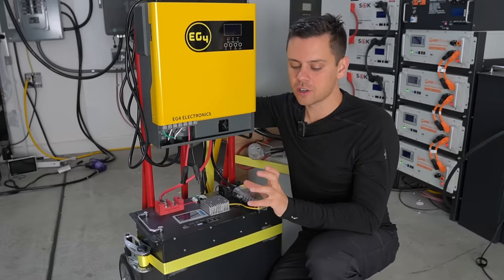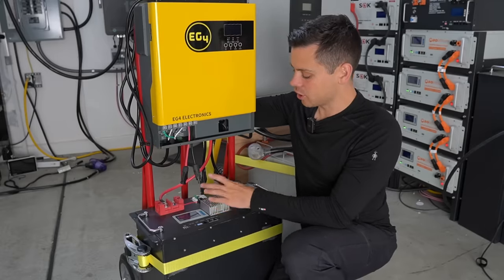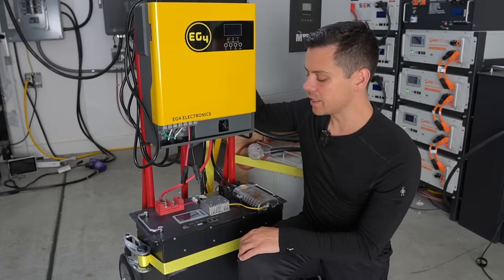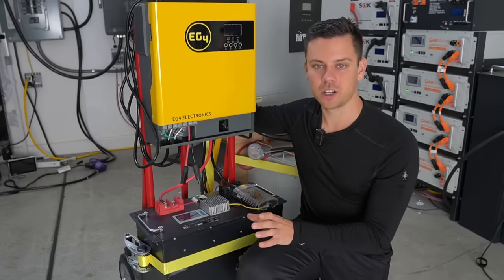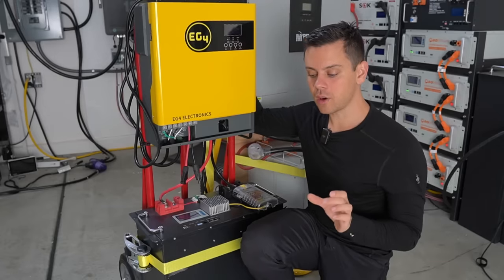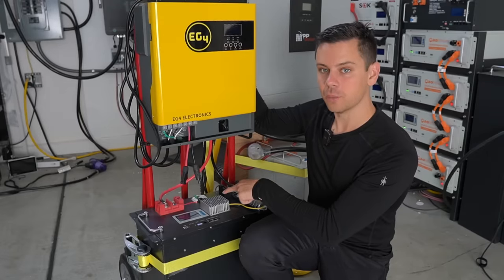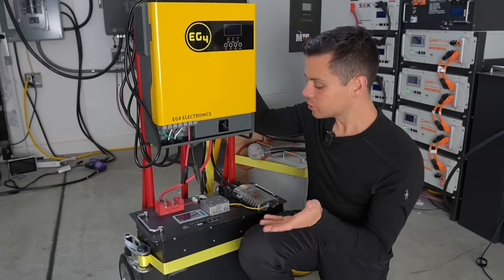The only issue is alternator charging. The solution for that is buying a 48 volt externally regulated alternator and charging this battery directly with that — that's the smart way to do it. You do not want to use your vehicle's charging system to charge deeply discharged solar batteries; they're not designed for it. You should have a separate alternator for that. Also, if you have a small array and want to connect it to this battery, there are boost converters available through Renogy so you can have a 100 watt panel charging a 48 volt battery even though the voltage is lower — that's what we used on my golf cart build, and I'll have a link below.